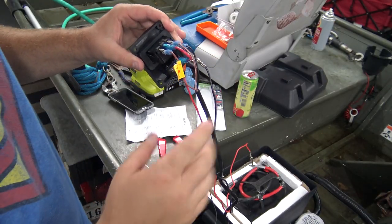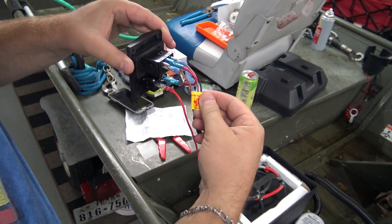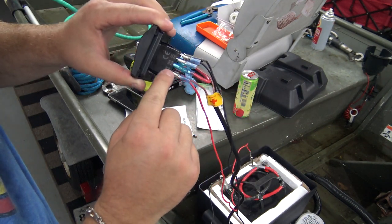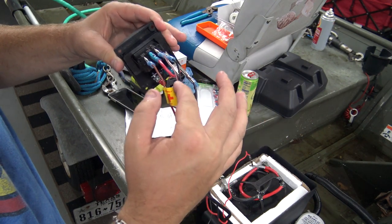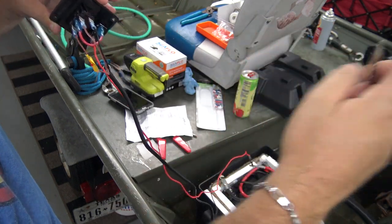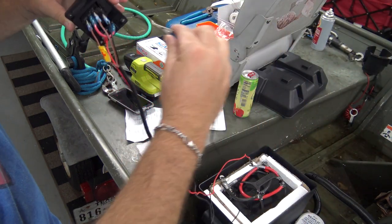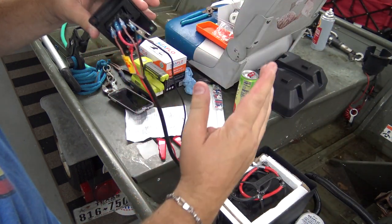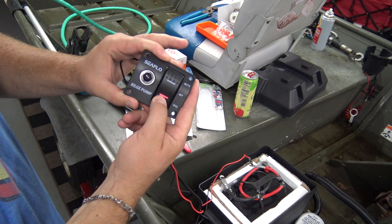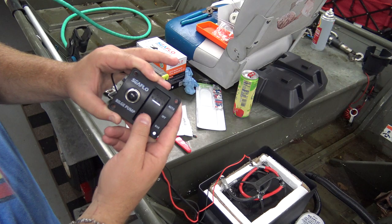Here's the brown switch — when you get it out of the box it says connect to positive only, and I have that connected to the lower one. I have the brown and white connected to the top. We have the ground coming from the bilge pump up here, and then we have the ground from the battery alligatored on there, so I can do manual or I can do auto.